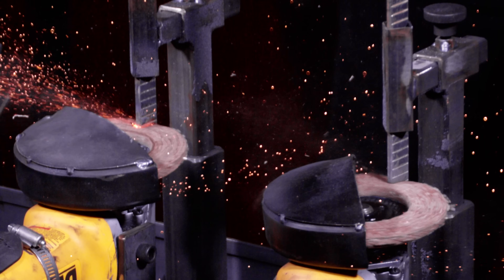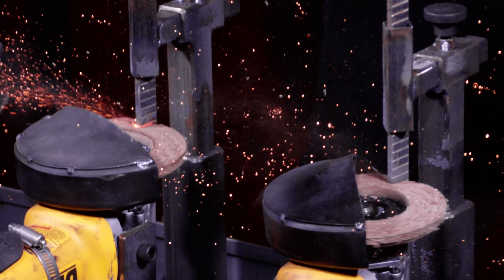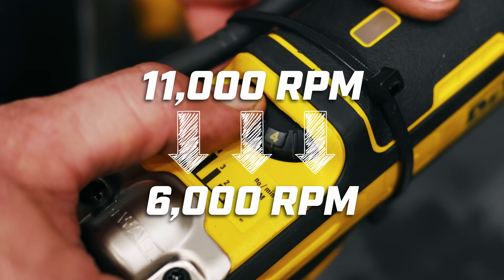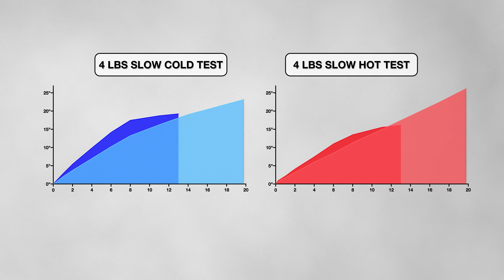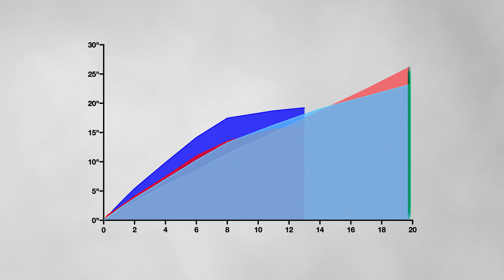To get to the bottom of that negative review, I tested how the disk performs at lower grind speeds, since slower speeds could impact durability. I kept my 4 pound weight and lowered my grind speeds from 11,000 RPMs to 6,000. The results surprised me — instead of being worse, the disk actually excelled. In the cold test, it cut off 23 and a half inches from my coupon and lasted the full 20 minutes. In the heated metal test, the 3M took off about 3 inches more, as we can see in the graph.